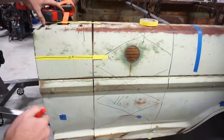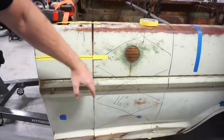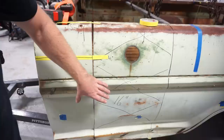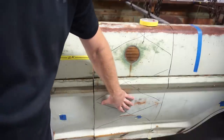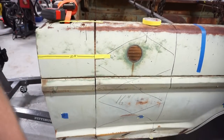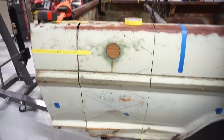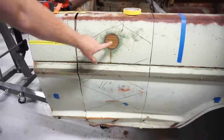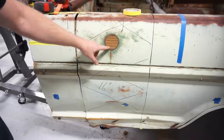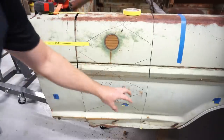So the reason I came back the 10 1/2 inches off the front is because there's an unused brace here that runs right through the center of this. So this truck also had some body damage on it. So taking out the 16 inches here at the rumpled up part of the bed, and with this extra auxiliary gas tank fill hole punched through here, it removes that as well. So we will lose one brace that runs through here, but that brace was not used